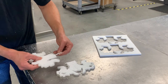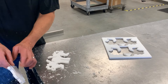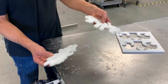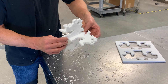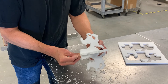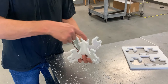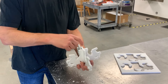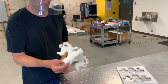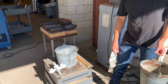Now I'm going to remove this little portion right here and pop it right out. I'm going to take and join the two pairs of foam pony patterns together and push them all the way together until it's approximately flush right there and stops. Now I have the top. This is going to form the downsprue and the gating system for our ponies. So we're going to fill up our flasks — these galvanized steel pails will be our flasks.